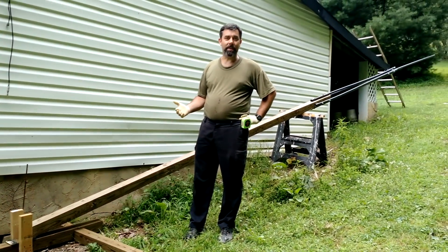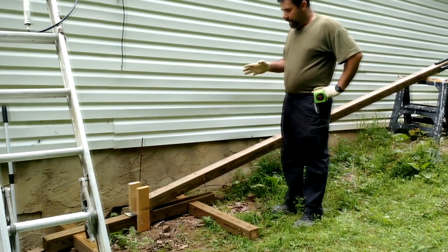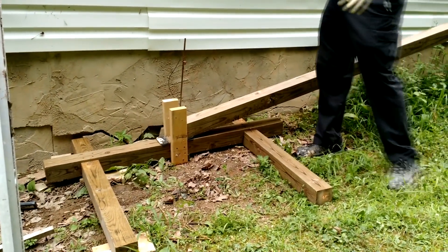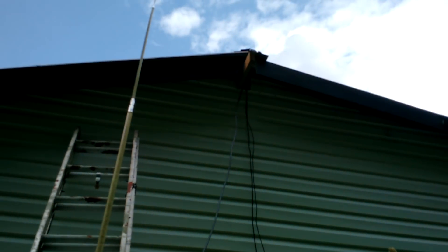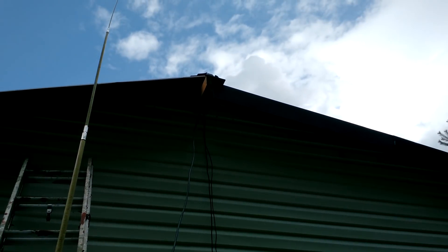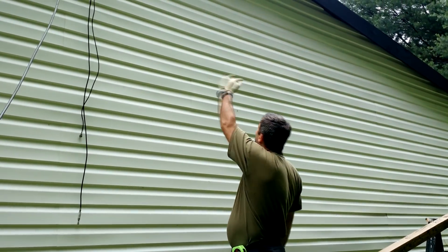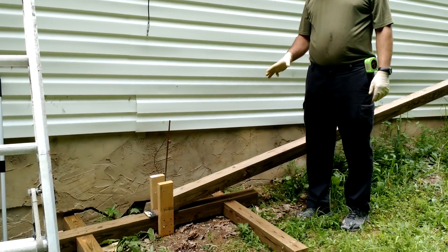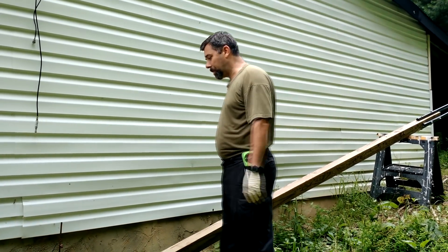Now we've taken the bracket, brought it over here, and it's time to start assembling everything. The bracket's in place — it needs to be leveled a little bit — and I'm going to pound rebar into the ground to hold all this in place. All of this will be reinforced with a tripod once this thing's up. We go up, and I've got a 2x4 that attaches to the main beam of the house, and that's going to hold the 4x4 when it reaches its apogee — when it reaches the perfect top. I'll put another 2x4 along the other side to hold it in place, then run cabling across and over to where my radios, TVs, and all the other stuff are in the shop. I've got one ground rod in the ground and I'm going to be adding a second — maybe even a third — because this thing is going to be sticking up pretty high and I don't really want to burn my garage down.